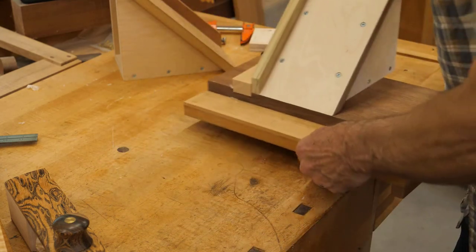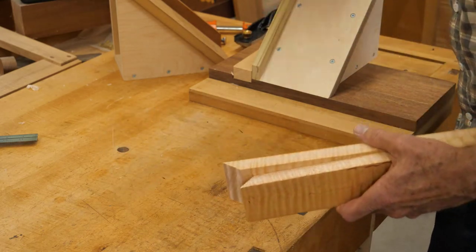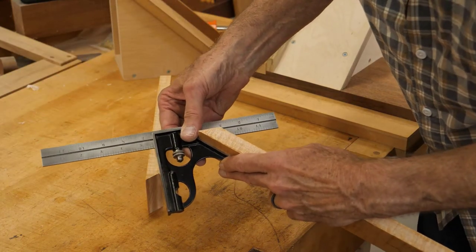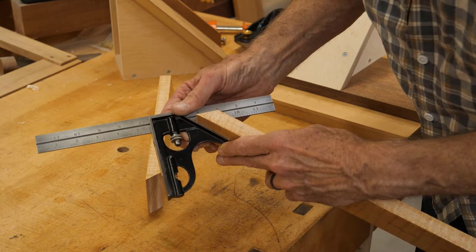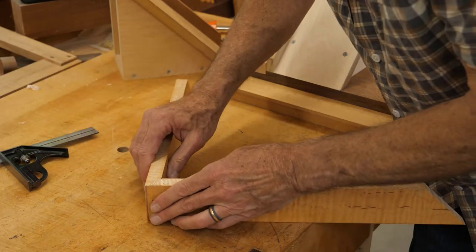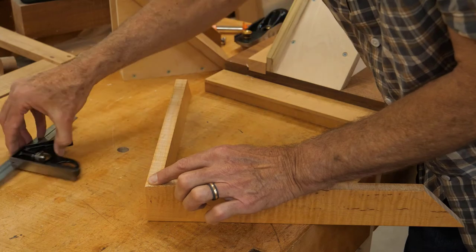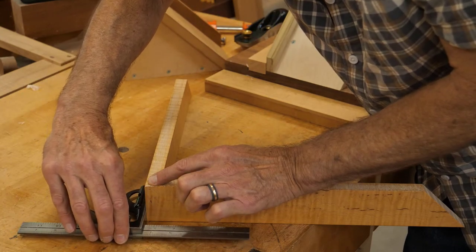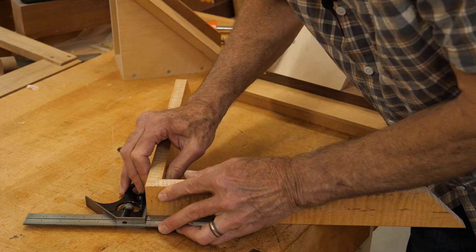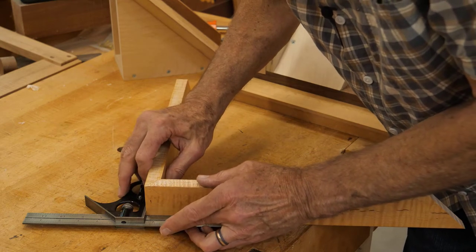Fortunately that lined up very nicely. The other thing I need to check is whether I'm at 45 degrees. You can measure one piece, and that certainly looks pretty good — it might be off a hair. What I find is better, though it's a little trickier and easier with two people, is to hold both pieces together and check for 90 degrees. So holding that, yeah — I can wiggle that a little bit, and checking at 45 confirms it: it's a little steeper than I want.